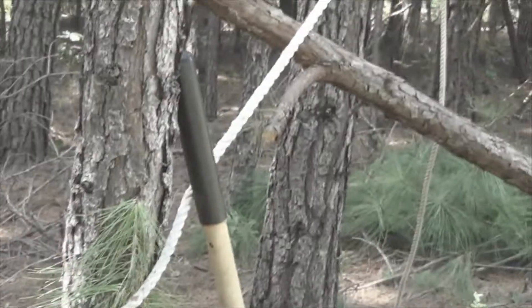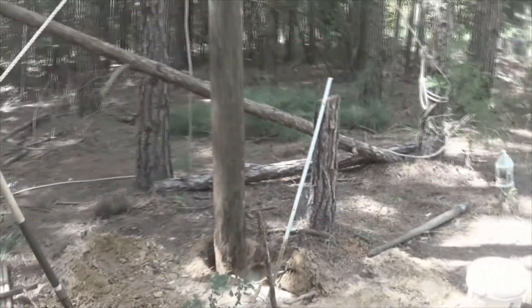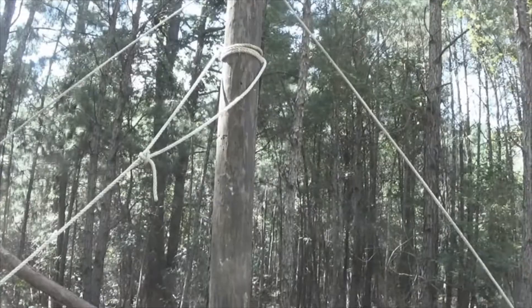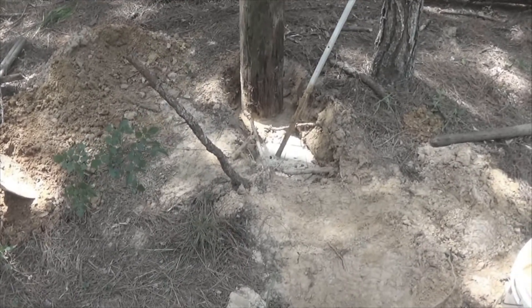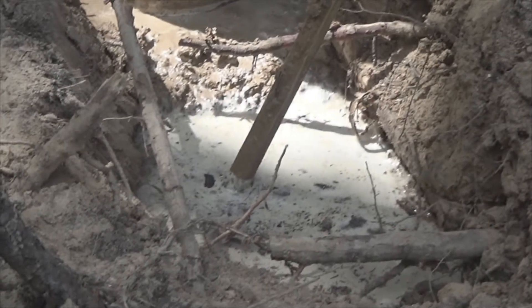This other rope that you see in front of me, which goes over here on the ladder and comes up — when I was lifting this thing up, what was happening was the pole was moving to the right, and I needed it back over to the left, so that's why that rope is pulled to the left. What I did was I punched my hole into the ground five feet, then dug out this little area right here so that I could pull the pole in, and as I started to lift up it would start to go down.